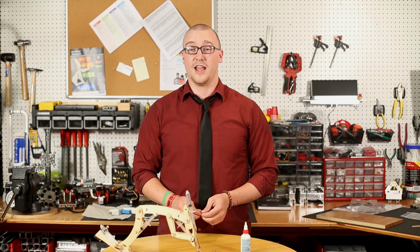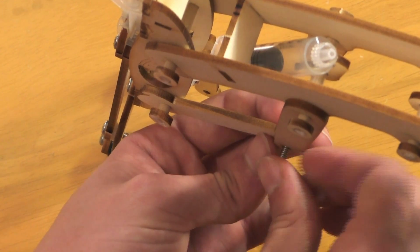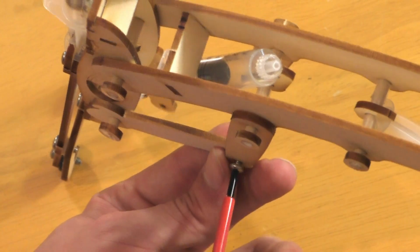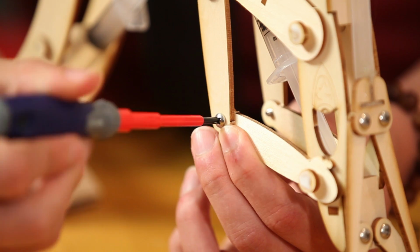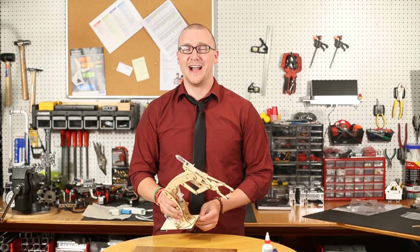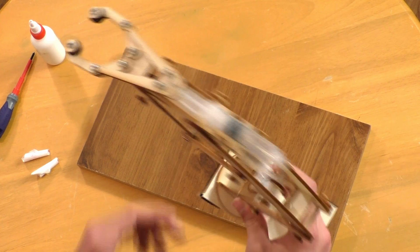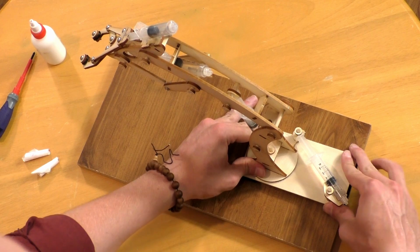Now line up the holes on your X and Y pieces and secure them with a 3/8 inch screw. Make sure that the Y piece is on the inside and the X piece is on the outside. Secure the screw with a Phillips head screwdriver. Repeat this step for the other side. Take your constructed T-Bot and remove the backing from the hook and loop fasteners on the bottom side. With the backing removed, take the T-Bot and place it on one end of your base.